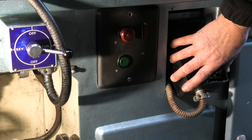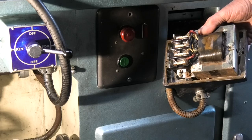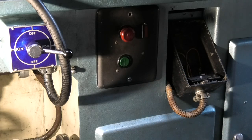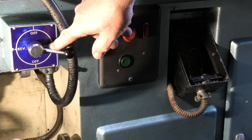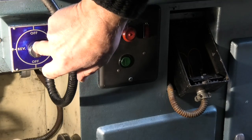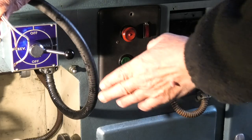I've removed the transformer from here — this was just converting 240 volt to 12 volt for the lamp. It's quite a big piece of equipment just to do that. I've ordered a new smaller transformer since I'm changing the lamp to an LED. I've still got the old on/off button for the mains power — I won't need that anymore. I'm thinking of fitting the pendant on a bracket using the hole in the lathe for the cable. The new cable is already connected to the motor and already attached to the inverter.